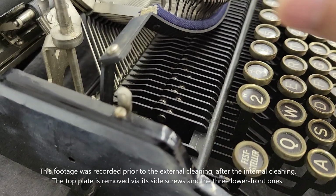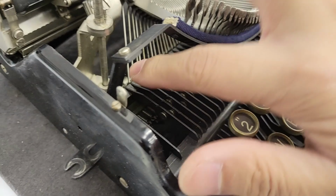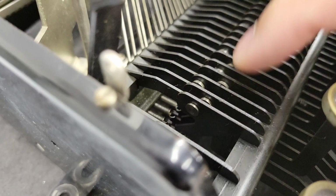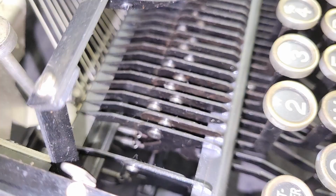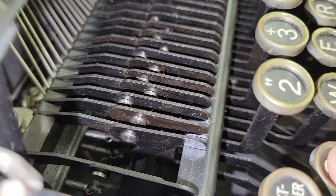So basically, what we have are class 2 key levers, and your pivot block for the rear pivots here is all the way just in the middle here, as opposed to being further back behind the machine. Then, in an interesting fashion, the effort vertex of this class 2 lever is over here and pushes down on a special bell crank where its front pivot is implemented as a sliding or corner rolling surface, like so. So technically it starts off resting on the front end, flattens, then moves like that.